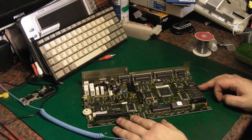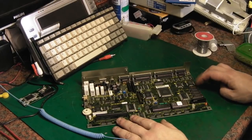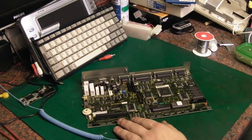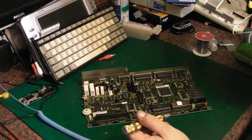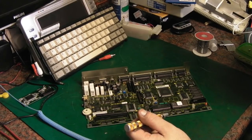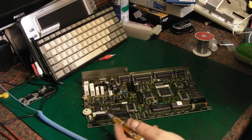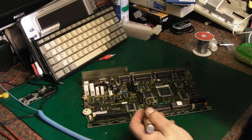We've got two 256K by two ICs there — by eight each. That's our 512K of RAM on-board. BIOS is there. I haven't spotted the 8086 processor yet. I'm wondering if they're using something custom and Toshiba — it's certainly not a standard 40-pin 8086 or 8088. Nothing like that on this board. Could it be that T7885 Toshiba chip? That's a bit perplexing. I was expecting to find something I could at least identify as the CPU, and I can't.